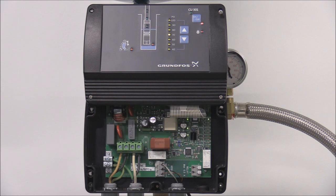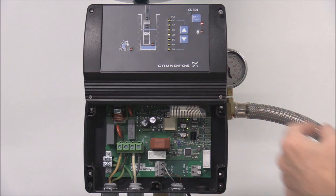To identify the cause of the service alarm, it is necessary to open up the front cover on the CU-301. Looking at the internal LEDs, there are currently three green lights. The top light is the 24-volt DC supply — a permanent green light means the internal 24V DC supply is okay. If the second light is permanent green, the internal 10-volt DC supply is okay. If the third light is permanent green, the internal 5-volt DC supply is okay. If any of those lights is permanently red, it means the DC supply has been overloaded and the CU-301 control box needs to be replaced.